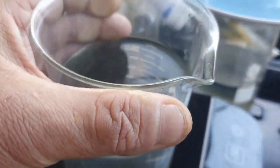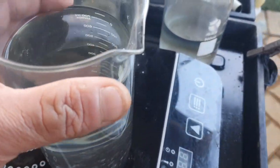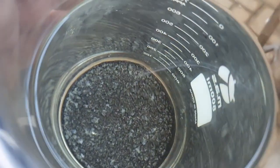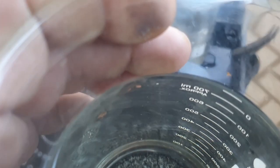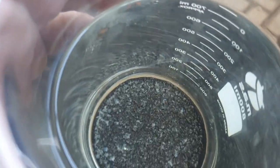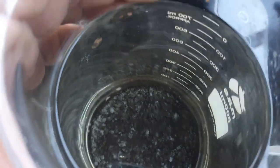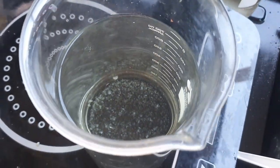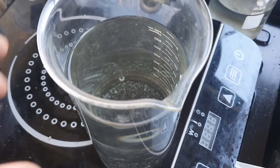Now, normally what I would do is give it 3 boiling hot water washes, then boil it in hydrochloric acid, and then give it 3 more water washes. But recently, on multiple occasions, even though I've dropped it with copperas, which is supposed to drop the gold and only the gold, I've washed the sediment many times, and then I've put it in hydrochloric acid and it's dissolved. It's gone nowhere. And even after doing a stannous test, it's proving there's nothing in there, which bewilders me. And then I've tried putting SMB in there, nothing happens, it just vanishes.